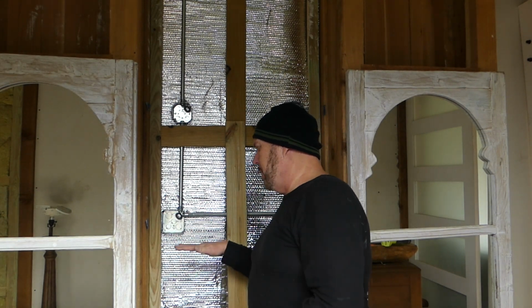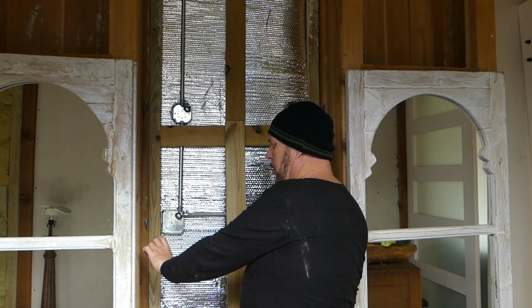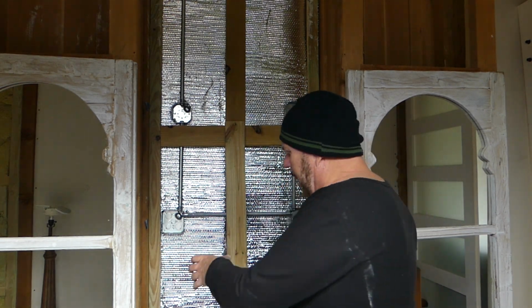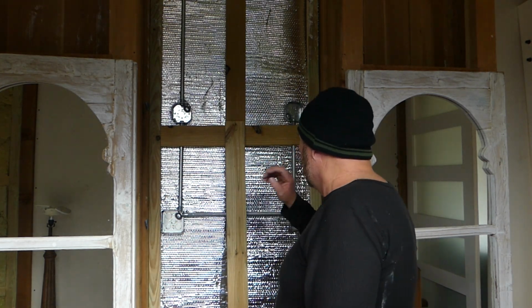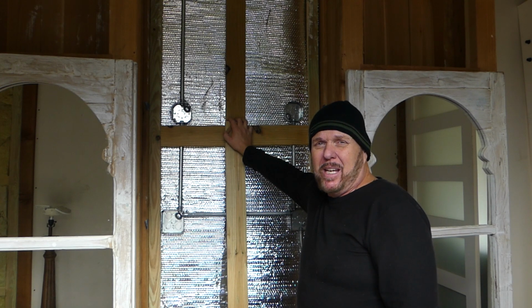When I do that poured countertop, I'll have the ice box already in place. I'll put a piece of hardy plank on it, cement board, and then I'll put molding in and I'll pour it. And I'll actually notch out the cedar so that the countertop will go in, and I'll put some supports in there so it'll be self-supporting. On the side of the icebox there'll be cabinet drawers that will go up and down, but this is just in case somebody changes that design someday.